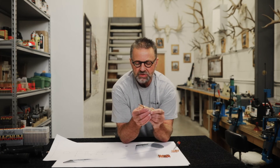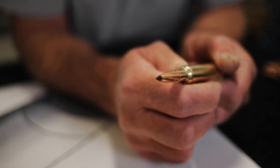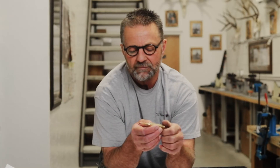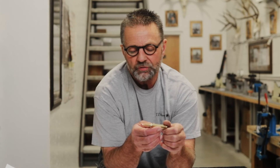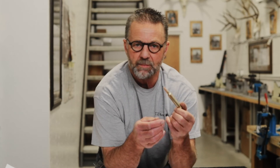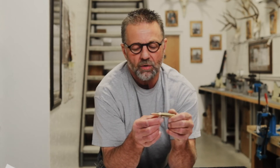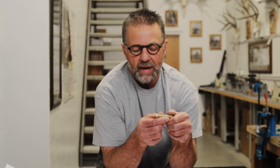One of the first concepts was this bullet right here. You can see the grooves starting at the nose and ending back toward the end of the ogive. Those grooves are cut at a 1-in-10 twist because the barrel I'm shooting this bullet down is a 1-in-10 twist. So I've increased the surface area of that bullet.